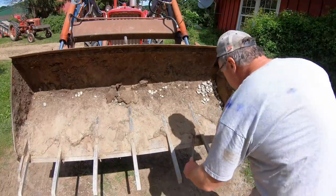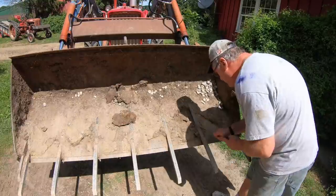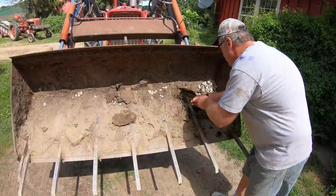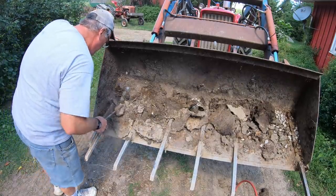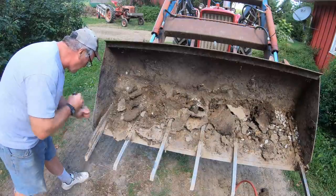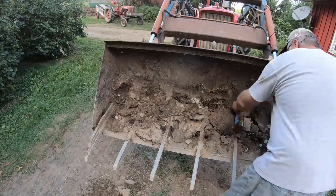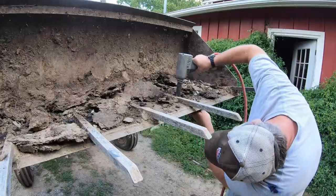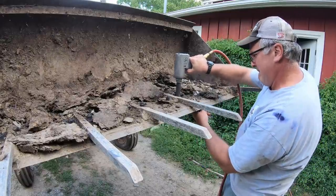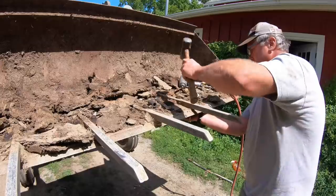Before I could start loading in stone, I had to get the bucket loader ready. My dad made a set of forks that bolt onto the loader bucket on my 504 tractor. Loading manure is just about impossible without forks on a bucket, because the bucket straight edge won't bite into the manure with all the hay mixed in with it. The only time I take the forks off is to move dirt or stone, and they hadn't been off in a few years. The manure had corroded the bolts, so I sprayed them with PB Blaster and hoped for the best. This is one job I don't mind using an impact wrench for.